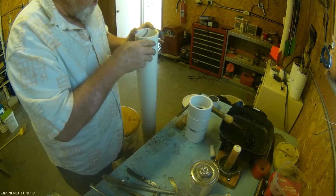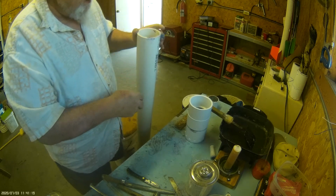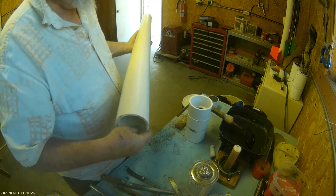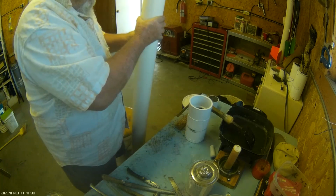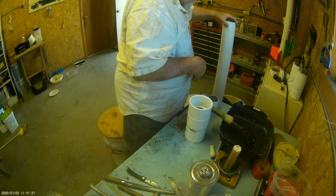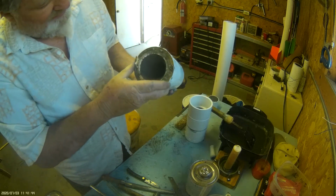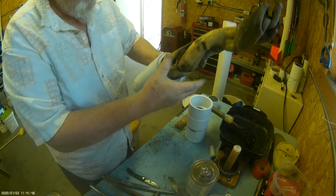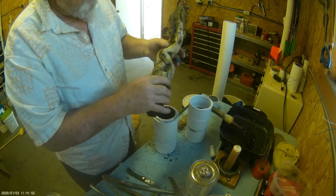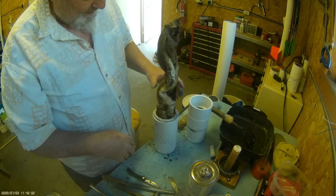And I put some on the liner. Then I slide them together until it comes down to the end. And the reason for this is because in the past I've just slid it in there. This is a nozzle that has fired once. And this is the liner, and you can see that since it wasn't attached to the tube, it has come loose and basically plugged the nozzle.